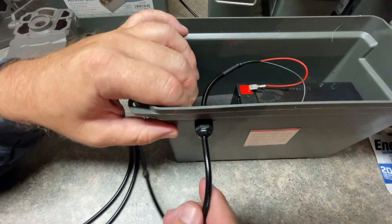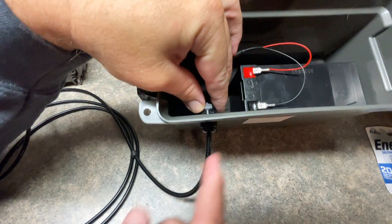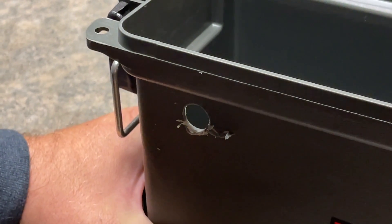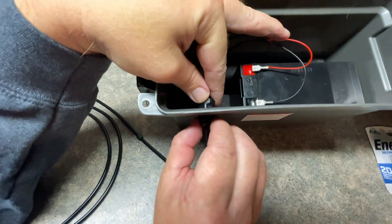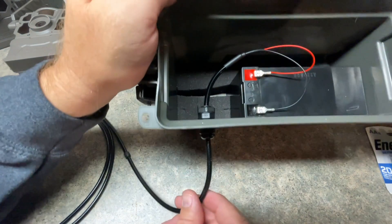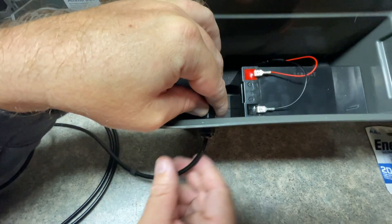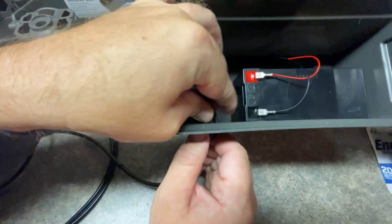One of the really neat features about purchasing this particular line from Herd 360 is that it has this two-sided nut. What you do is you just drill a half-inch hole into the box — that fatter drill bit, half inch. You then pull this apart and install it, fairly simple. What's neat about this is it has rubber grommets inside, so if I untwist it I can slide this line through freely — wherever I like. If I want to keep more line inside the box I can do so, and then counter-twist this nut and that just locks it in place.